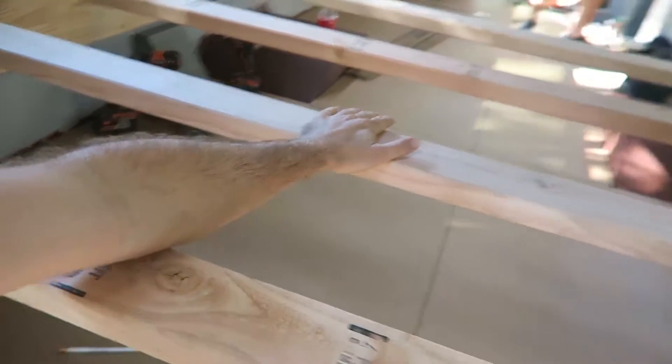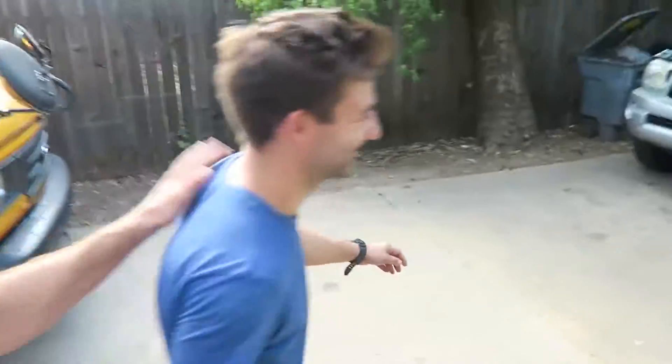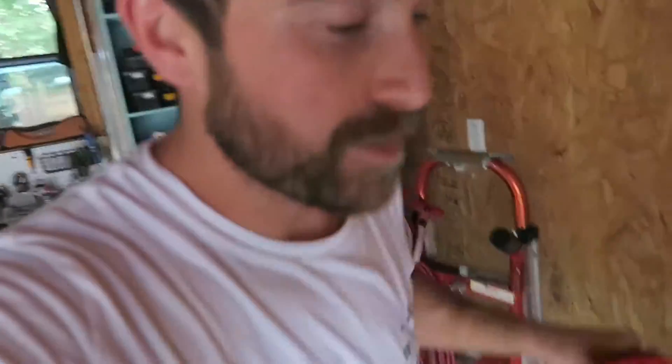Here is the skeleton of the bed. We're gonna throw some plywood on top and do a rough estimate measurement with the mattress on top to see how far it sticks out. While Chris is cleaning up the inside of the bus, I'm gonna grab the mattress — the yoga bed. Thanks to yoga bed for sending me a free mattress, that was really kind of you, especially considering I'm on a budget. We want to make sure it's not too short, not too long, so the best way is to put the bed on there, make measurements, and then cut.